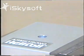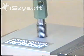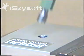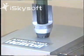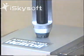Now we've seen the tricks of the trade, let us run over the main points again. A good drilled hole free of swarf is essential, followed by a good tapped hole free of swarf. Then, if the hole gauge is right, the insert will be a quality fit. Install the insert properly, making sure it is square in the hole.